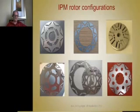This is the 2007 Toyota Camry V-shape with salient poles in between. And here's the 2008 Lexus design. Similar, a deeper V, longer magnets, more flux, but then they've added another slab magnet right close to the OD here. And I'm told by Oak Ridge Lab people who have assessed this design, they claim that Toyota's intent there was to add more flux in the centroid to the D axis to improve the sinusoidal back EMF wave shape. And then here's some lightening cooling holes on the ID.